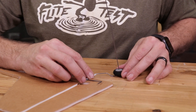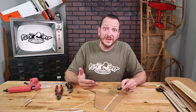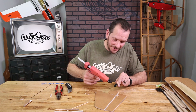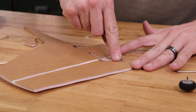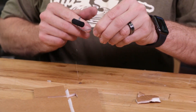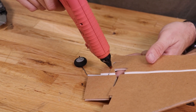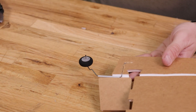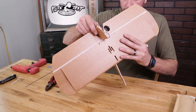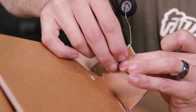See how she looks right here on the plane — that's going to have a really nice stance. Cut it about three or four millimeters from the edge. A real easy way to lock this in is simply a bead of hot glue, or you can take a little piece of heat shrink, slide it over, heat it up, and lock your wheel in. While that's fully cooling, take your extra little piece of landing gear wire, drag it through your score cut, and open up the cavity just wide enough for the wire to lay down. Once fully dried, lay this right over top and press it down into place. Follow up with a bead of glue over the seam just enough to fill the gap, and smooth that out with a piece of foam. With this locked in, we're not going to glue it down until we've installed it into our elevator — once everything is glued and secured, come back with a little piece of tape around the bottom shaft to secure it.